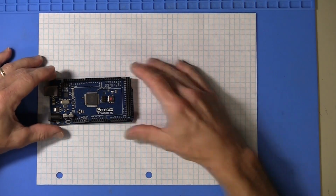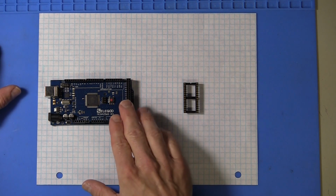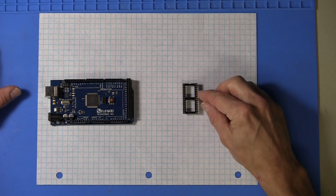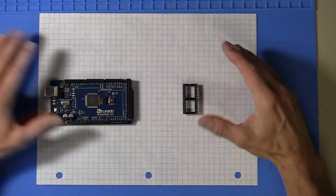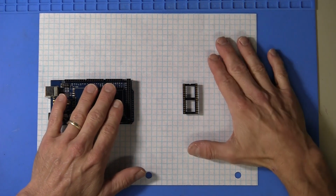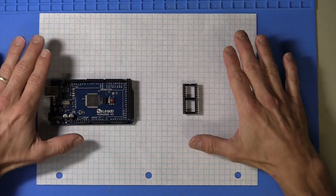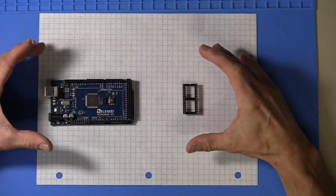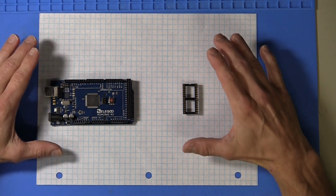Okay, we have our microcontroller and a socket. And we would connect 16 digital IOs to the inputs of the PLA and would bring back 8 outputs from the PLA to other digital inputs. And I'll write some code that will exercise the interesting combinations of inputs and check for the expected outputs. And then printf some information about what passed and what failed. All of this works in 5-volt domain, so there are no IO voltage level incompatibilities. Everything just naturally would work.